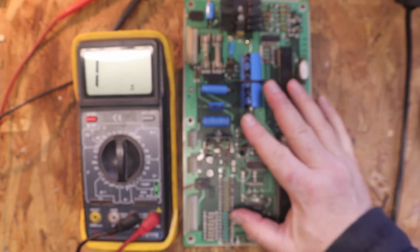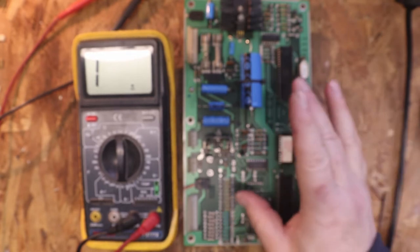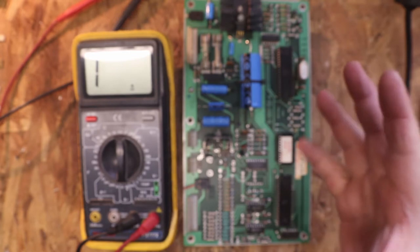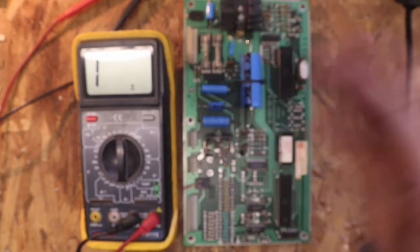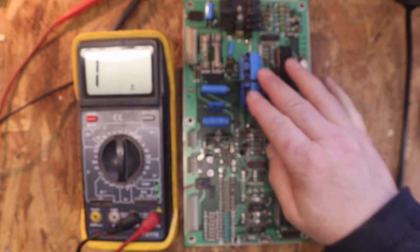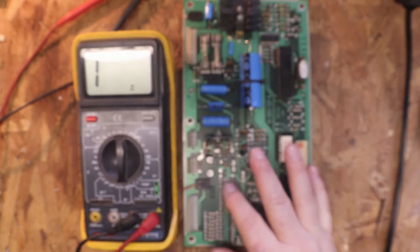We have the sound in there, but we have really bad static. I'm hoping that we're picking up some static through maybe some of these resistors that are just not cutting or filtering, which they're not really filters, but they may be sending too much to our caps or our filter capacitor. This should be the filter capacitor here. Usually the biggest one is a filter cap. So we'll get these three changed out.